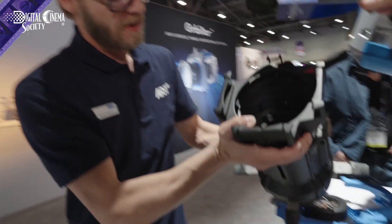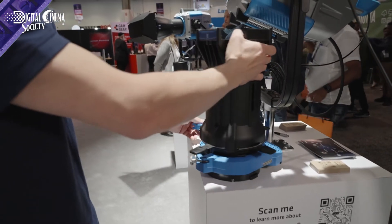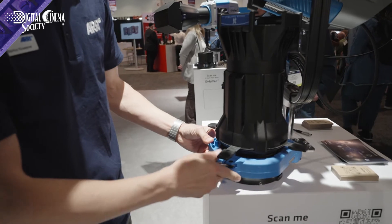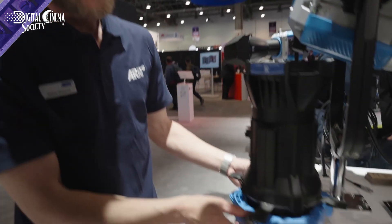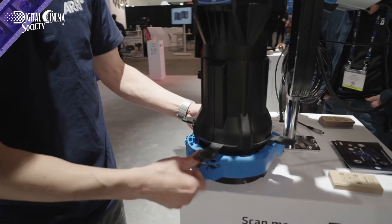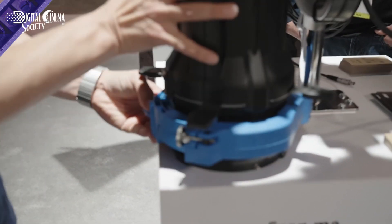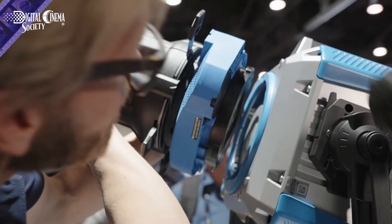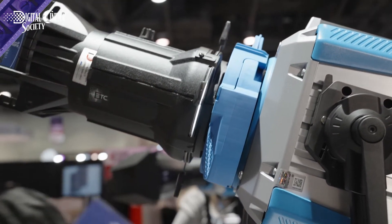Then you tilt a little and shift it over, close the lever, close the thumb screw and you're all set. We recommend keeping the thumb screw a little loose so you can still rotate the shutter barrel inside the docking ring for focusing. Then take the whole package, slide it into the QLM system, and that's it.